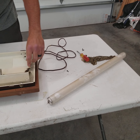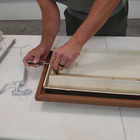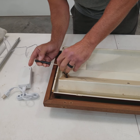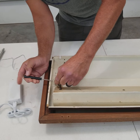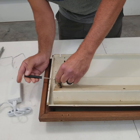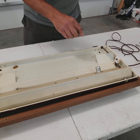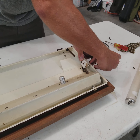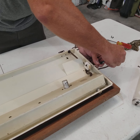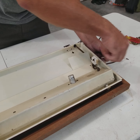What we'll have to do is break this case open to get all the old components out. We'll start by taking these tombstones out of here, get the wire unconnected. Basically everything in here is going to be abandoned. We'll get it all cleaned up so our double-sided tape will stick to it, then get all the LED laid into place. Get that igniter out of there.